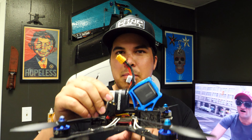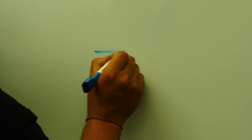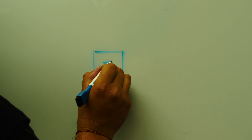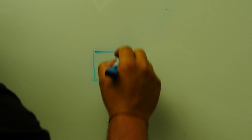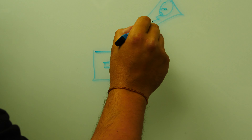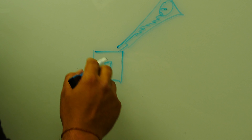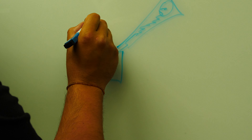I think what is going to work best is making a very good soft-mounted platform. I'm going to draw this for you guys so you get a better idea of what I'm talking about. So this right here is a flight controller; the little square in the center is a gyro. This is the arm and a motor. Most vibrations come off the motor, the arm, and the frame, and they affect this gyro and it goes all crazy — that's what I'm trying to fix.